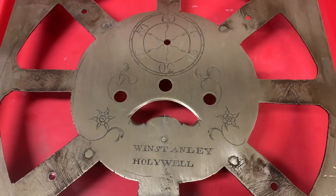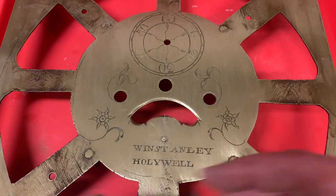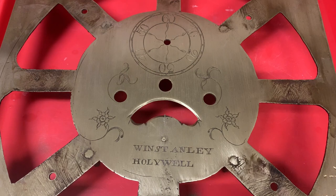The dial is rinsed off. I've left it wet — you actually need a little bit of water for this process. How I'm going to apply this is the same way we did it in the last video: I'm going to use a cotton ball mixed with the powder and a little bit of water to make a paste-like substance. We'll do step one first — the silver chloride — followed by the cream of tartar to brighten it.